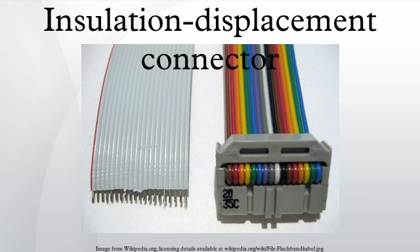In some types of telephone and network plug, including the BS6312 and the registered jack family, generally separate wires in a sheath are used. In these applications, the outer sheath is stripped, then the wires are inserted into the connector and a special termination tool is used to force the conductors into the contacts.